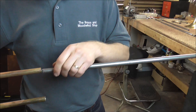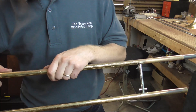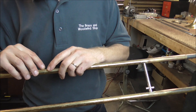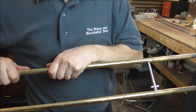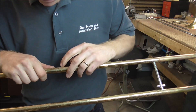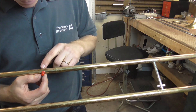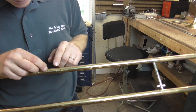Right now I'm going to get started and take those dents out. I have the larger mandrel for the outer slide tube, so I'm putting that on there. There is the dent. This dent has gotten a lot smaller since I had to partially get it out to remove the slides in the last video. I need to know how far the mandrel is on here — it's up to here, past the dent. So it's okay to tap on this dent now.